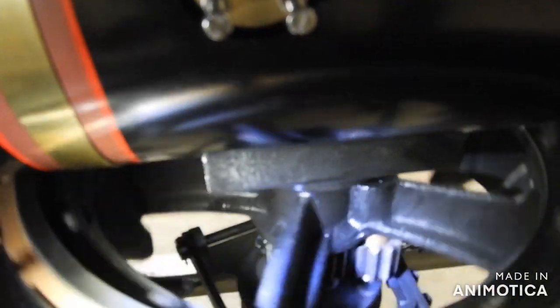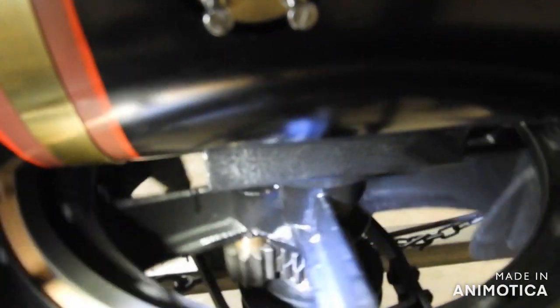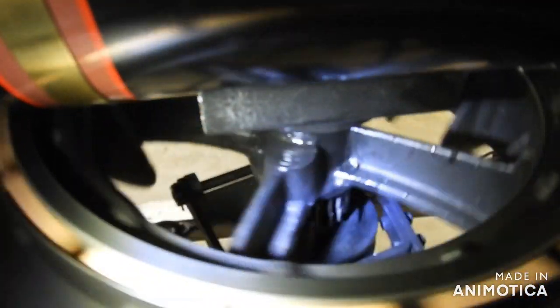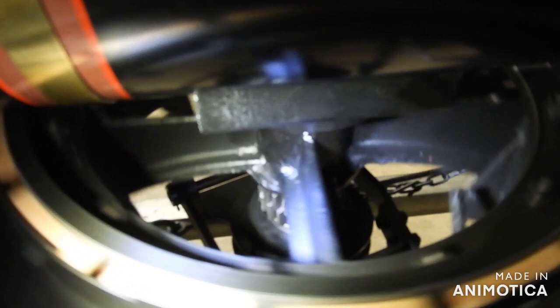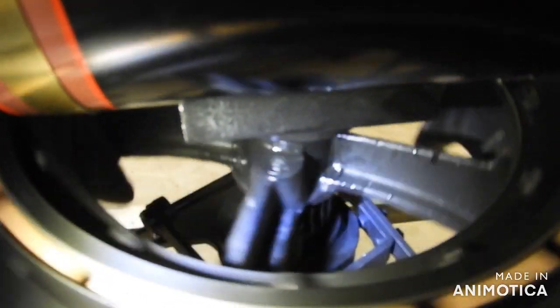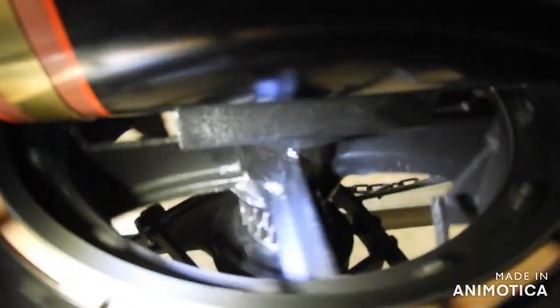This is the mechanism that moves the coiling arm to guide the rope onto the drum. The planetary gears advance the cam by one tooth per revolution, raising the guide rollers by one rope thickness each turn of the drum.